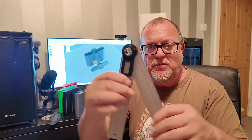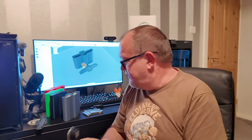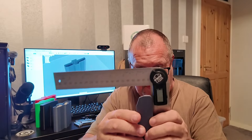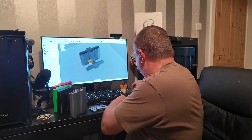Another item I find really really handy — I've actually got two of these. I've got one for my CNC machine in the shed and one for my router. This one is made by Trend, one of the better makes — I'll put a link below. This is a digital angle finder. It's got a steel rule on there as well, though the rule isn't fantastic because the digital unit gets in the way. But you can zero it out at any position — 90, 70, 10 degrees or whatever — and then measure or set angles on bits and pieces. For example, you can measure an angle like so — obviously it's 90 degrees there. Great bit of kit, very very handy.